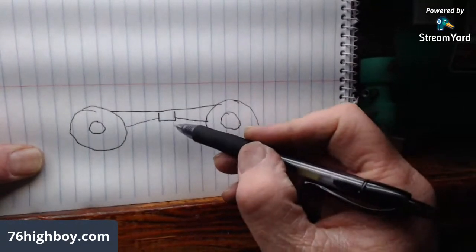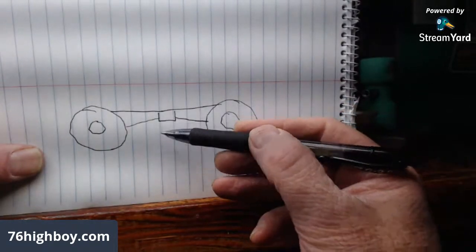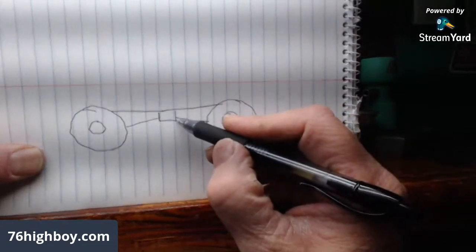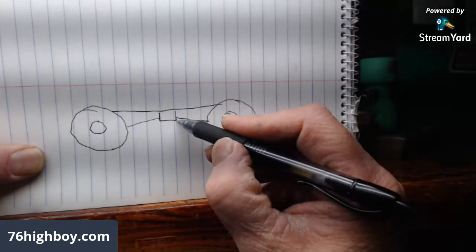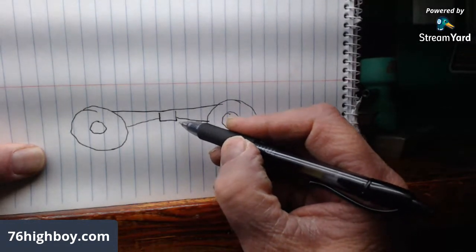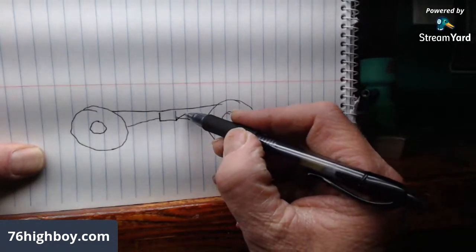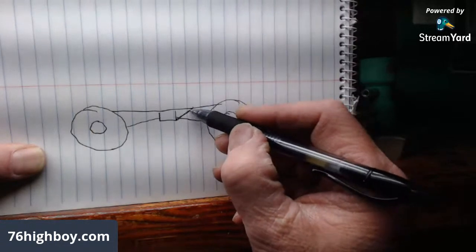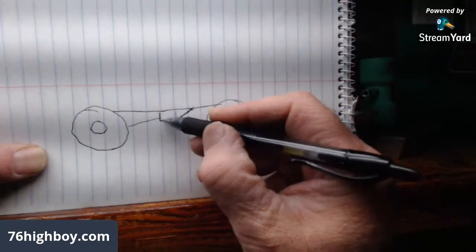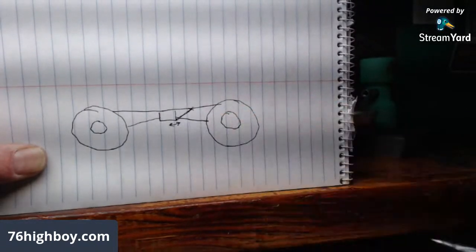And so what happens is with the low-hanging 205 transfer cases, you drag them in the mud. Well, from the factory, those old highboys, I can't remember if they went to the rear or the front. I own one today. After 25 years, you'd think I'd know this, but there was this bracket. It went from here up to the cross member of the frame. And what this did is it kept this transfer case from going too far back and forth.